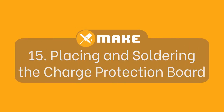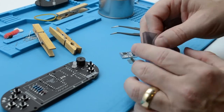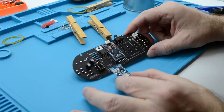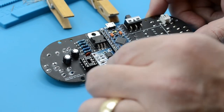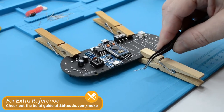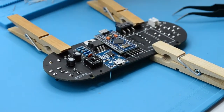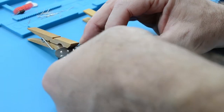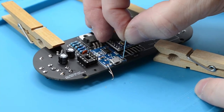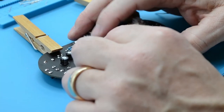Fitting and soldering the battery management system. Unpack the battery management system from the bag. You should also get some header pins in the bag but we will not be using these — this is where the resistor legs we put to one side come in handy. Place the battery protection board in its outlined position on the PCB, with the USB connector facing outwards. Using the trimmed resistor legs from before, place them in the four outer holes on the protection board. Bend the pins to help secure the battery system in place so that when we solder it, it doesn't keep moving around. Go ahead and fit and bend all of the legs on the battery system board so that it is secure and we can solder all of the pins in place.